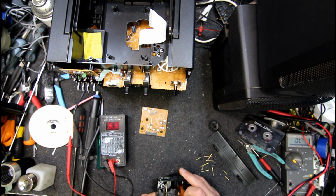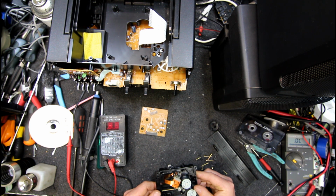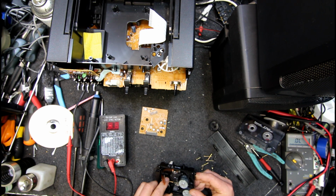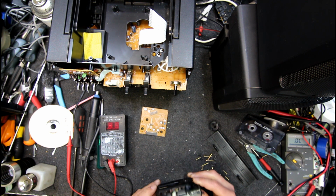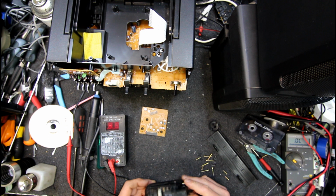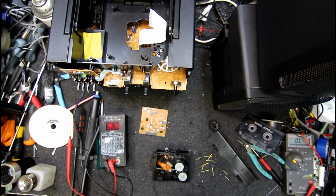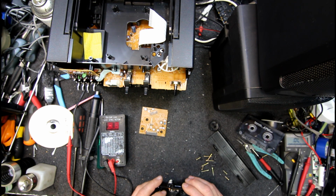So that's the spin motor. Don't know what sort of laser that is. Could that get dust in there? I reckon it probably could, although the whole thing's pretty clean, so that would suggest that's not the problem, but it doesn't mean it's not faulty. That motor seems to make a lot of noise, but I don't think it's... I guess we could double check like that. The motor's not open circuit or something weird, but I doubt it. It's most likely this laser.